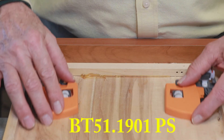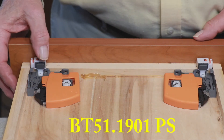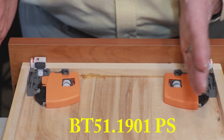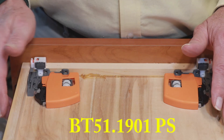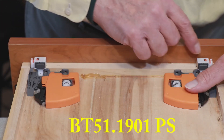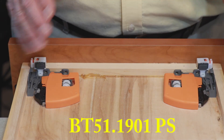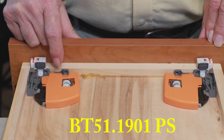This is a really nice front locking device. You need to drill your holes at an angle to get into your subfront and prevent splitting. It has the three-millimeter up and down adjustment like all the others, and side-to-side adjustment of 1.5 millimeters each way. But the super feature on this is that it's designed for inset drawer applications and has an in-and-out adjustment built right into this locking device. It gives you the in and out, the left and right, and the up and down — so if you're doing an inset drawer, this front locking device is ideal for your application.